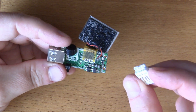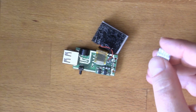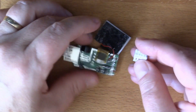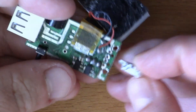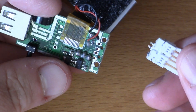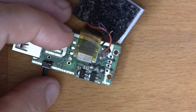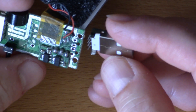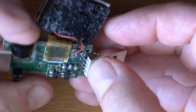So there's the old connector. I was able to use the old desolder gun - my RS desolder gun from decades ago - and was able to remove most of the solder. First of all I prised up one pin at one end and then it all sort of came apart relatively straightforwardly. So I've got some new connectors and all I need to do now is fix one of these new ones in the place of the old.